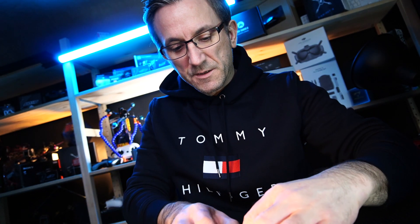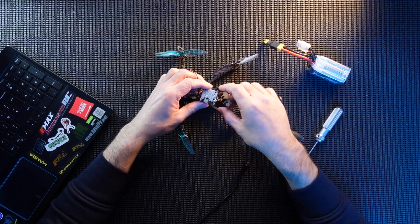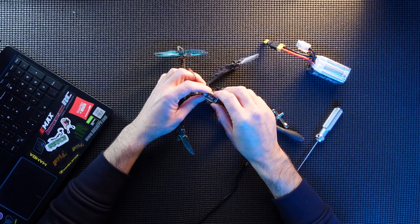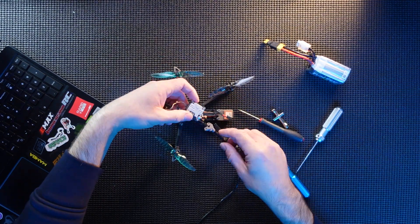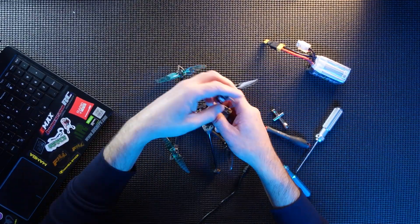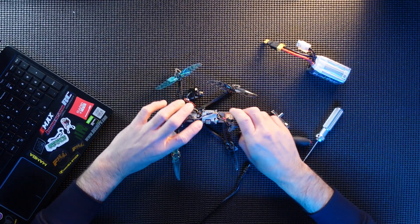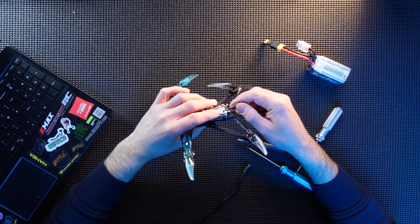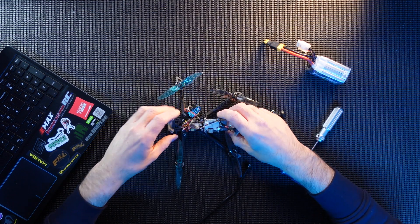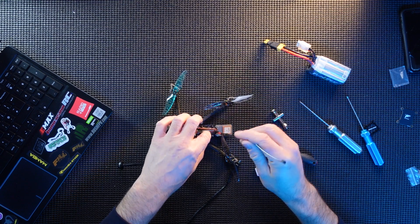So what I'm going to do - the only thing I can think of is something to do with the Caddx unit. I had the cables going underneath, so what I'm going to do is put them on top instead and see if I can keep them out of the way a bit better. It's almost flipping the unit. The thing I don't actually like is the power cable - it's right by the GPS cables, and if the VTX is disturbing it, maybe the actual power cables are causing a disruption as well. I'm going to try and zip tie the power cable over here, just so it gives a little bit of separation.